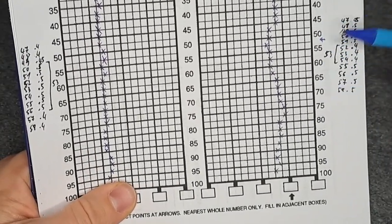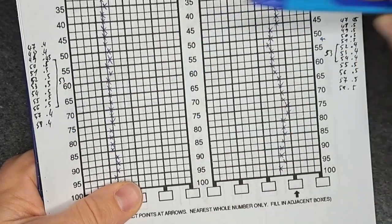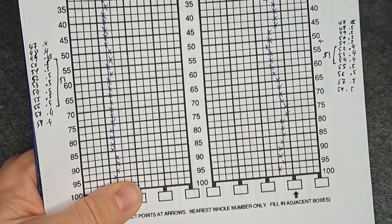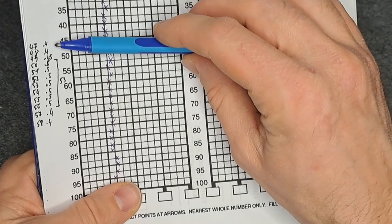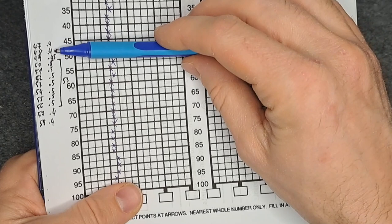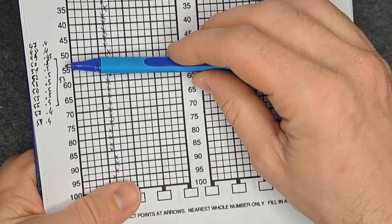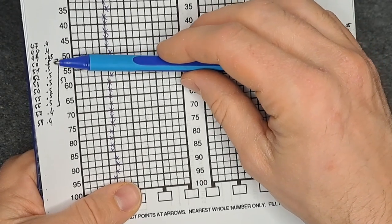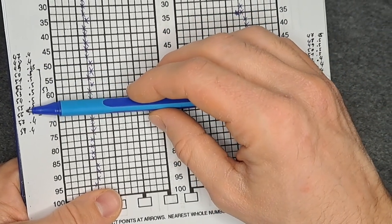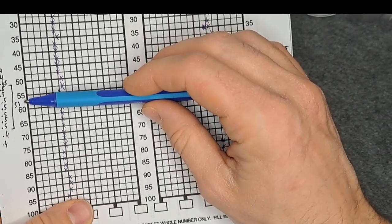And down here I did the graphing a bit differently. I just made a table with the numbers I wanted to scan, so I went from 47 to 58, and I noticed that the left contact point goes from 6.4 to 6.5, back to 6.4, and basically the higher indication starts at 50 to 56, so the center of this gate, which is quite wide, would be at 53.